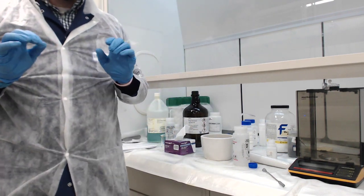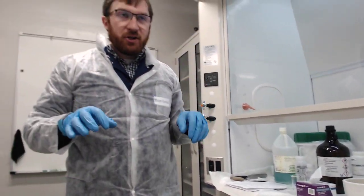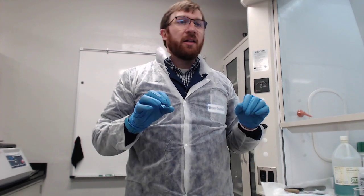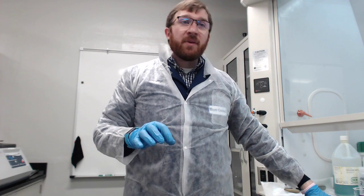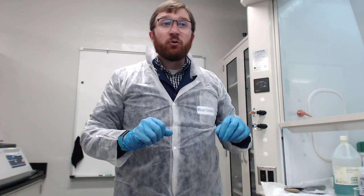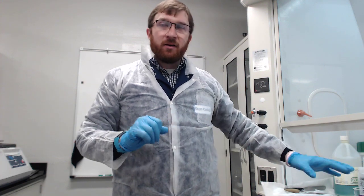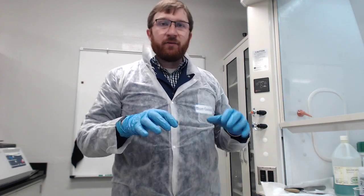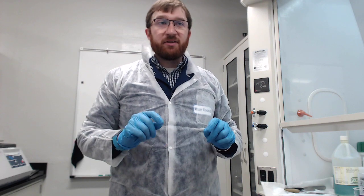So we've got our batching done. As a reminder, make sure you're writing down the values just like you would in lab — make sure you write down those masses because this is your reading for those values. I added this last batch to the mortar and pestle. The yttrium and barium carbonate are white, and the copper oxide is black, so right now you can see those individual particles. As we mill this in the next video, you'll see changes in the physical appearance. This was the batching for Monday B — but everybody can look at this for the overall process. The next video you'll watch is for milling. See you in a bit.